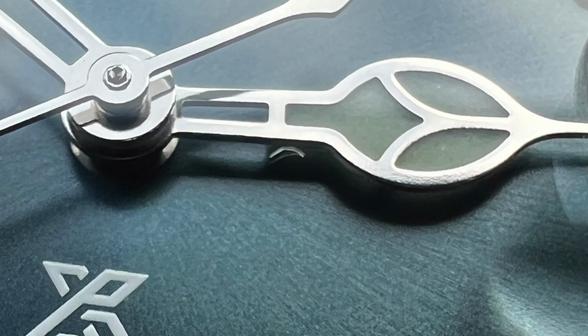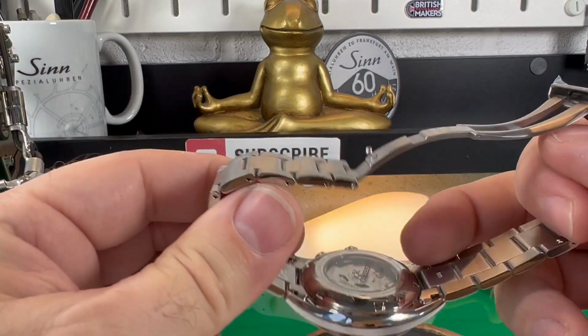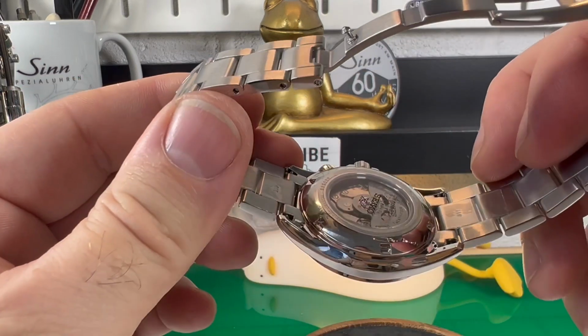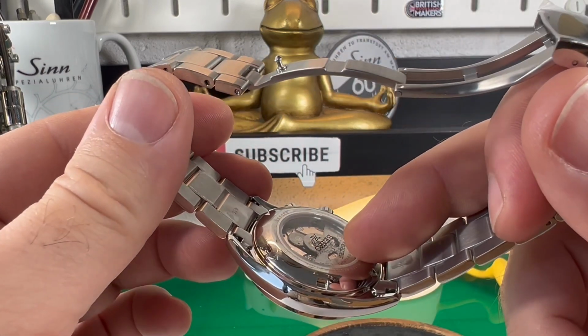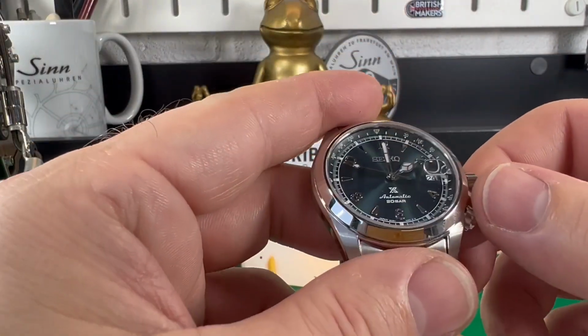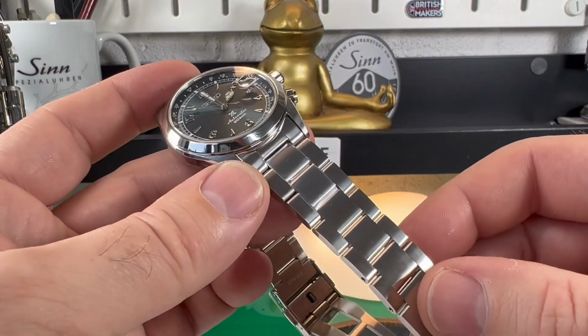But there are nice things, like it's bi-directional winding. What I mean by that is on some movements, if you spin it one way, the rotor will spin happily and freely. That's because it's not winding. This has got a magic lever system and it will wind both ways, which makes it more efficient. Companies like Jaeger-LeCoultre actually do use the same system. So, it is a good system.